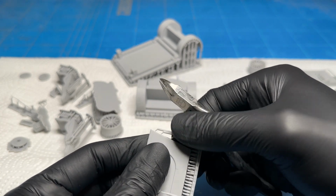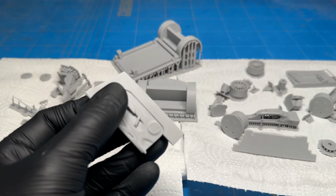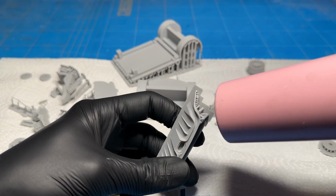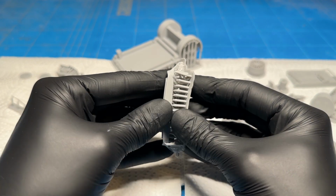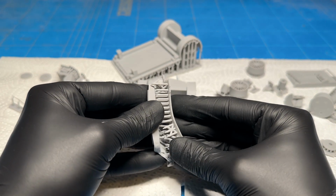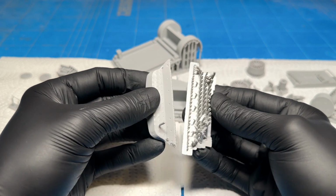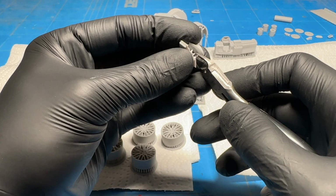That final cleaning stage is done on the UW3 from Creality, which is the washing and curing station. In this case, it is turned into the washing station with some alcohol in the container that cleans off all of the resin. With that completed, I take all of the parts out and let them dry nicely so that all of the alcohol evaporates. The parts are clean and dry, but not yet fully cured.